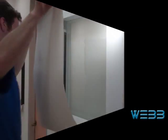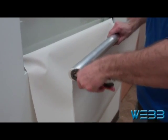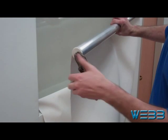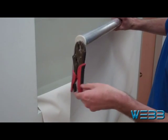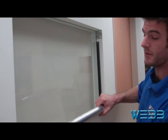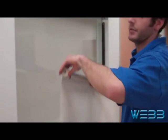Remove the shade. Grab your vice grips and attach them to the drive pin. Remove your tension pin, and you're going to turn it clockwise to add tension. Once you've rotated the drive pin, replace your tension pin and replace the shade.